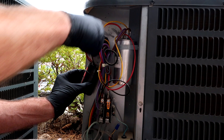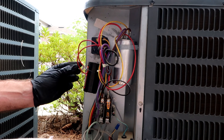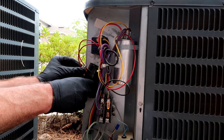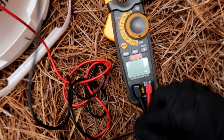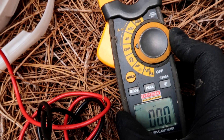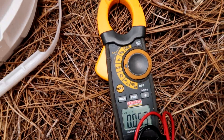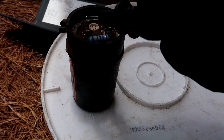If I can get the wires off — giving me a hard time — there we go. So you just pull the two wires off the terminal and check it. I'll slide it out and do it on the ground for you — I'll just take the whole deal out. Got an old meter, mine says CAP right there — C-A-P for capacitor. That's how I test the hard starts and capacitors. The other meter will say MFD if you got a Field Piece — put it on MFD for microfarads. We just pull the wires off these terminals here.